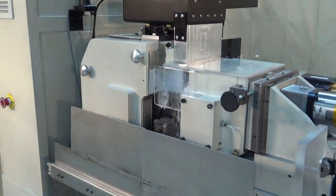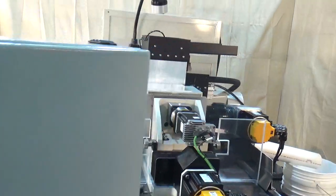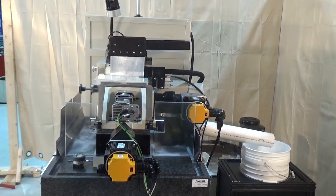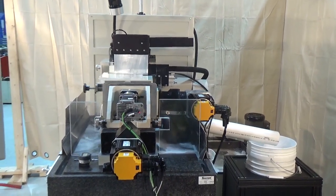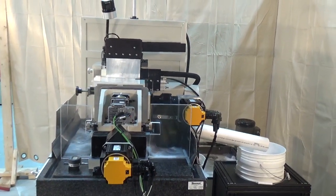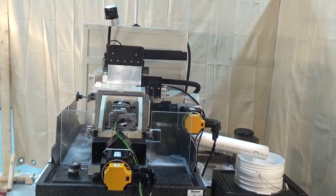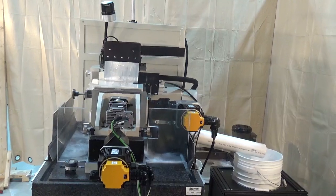Using a grinding wheel 12 inches in diameter and 8 inches wide, we design the wheel form to the contour of the spherical shape and fill as many positions across the 8-inch wide wheel as will fit. This application has five balls, each 35.5 millimeters in diameter. The regulating wheel is 8 inches in diameter and 8 inches wide. It rotates at an RPM to control the rotational speed of the balls, and oscillates to keep the ball moving off-axis and create a true sphere.